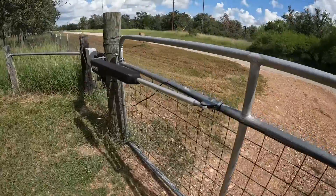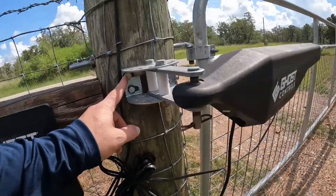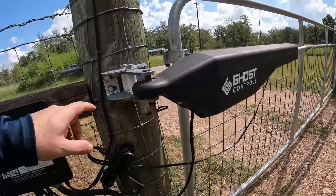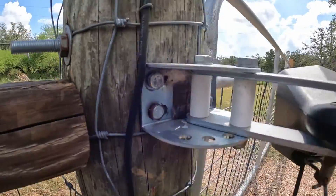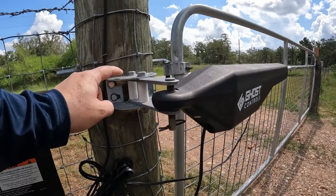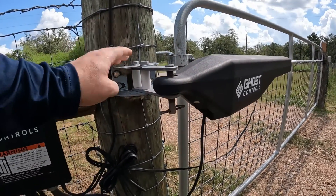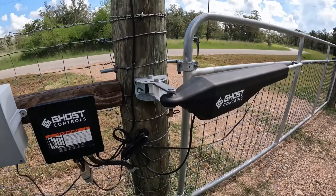What I noticed the other day when I came out to look while adjusting the gate is that these lag bolts on the control arm down here are loose. This one could definitely go in a little bit, and it actually moves back and forth when the gate opens and closes. We're going to cinch this down and hope that helps with this constant readjusting.